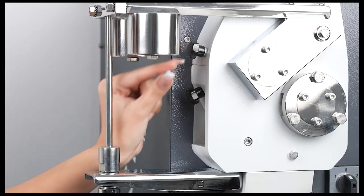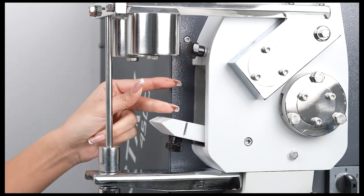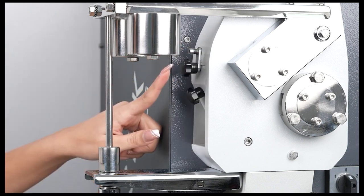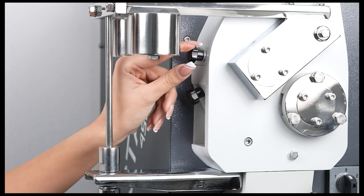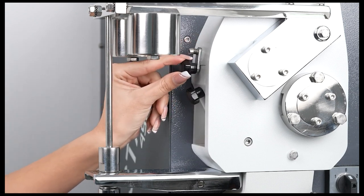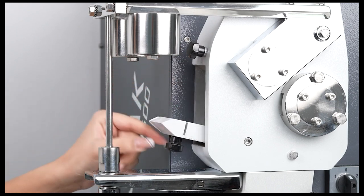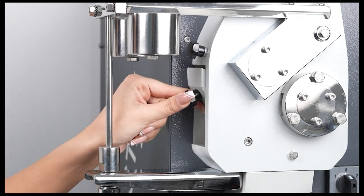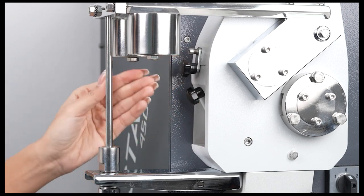In the smooth section, on the left side of the ball housing, there is a unit for cleaning the smooth section and a compression handle for the cleaning unit. During the compression of the roller balls, the handle is pulled to the right or left to release the unit. The unit is manually pulled down to open the cleaning area, the space between the roller balls is cleaned with a brush, and then the unit is lifted back up and placed in position. The unit is compressed using the handle.